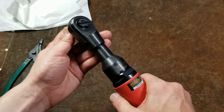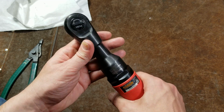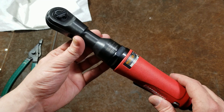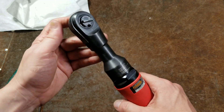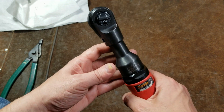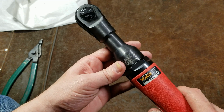The big issue is that it's torquing itself back and forth. So if you're trying to break a fastener and you don't manually break it first and you just hit the throttle, it can smash your knuckles into something. Many people have experienced having their knuckles racked using an air ratchet, or in a situation where they're trying to run in a larger fastener that stops and then — boom — racks their knuckles the other direction. So the whole solution was adding an impact wrench.